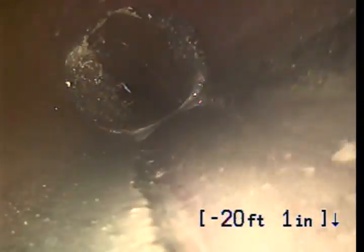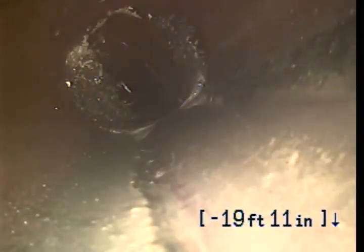Most of the line's clay tile is in good shape. Here's another little root intrusion right there. A 3-inch auger or 3-inch cutter is probably just going to bypass it. It's not even worth trying to waste the customer's money.